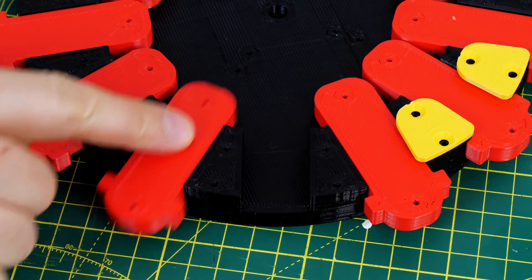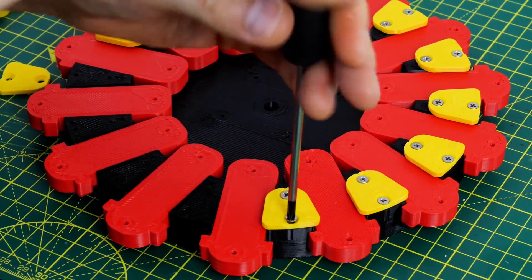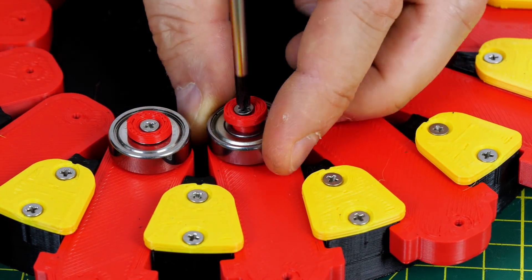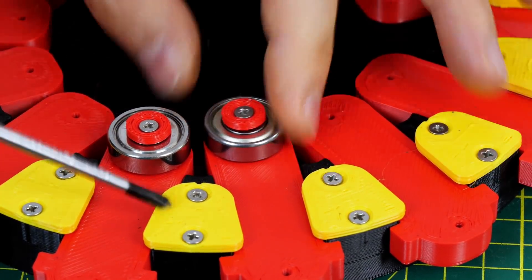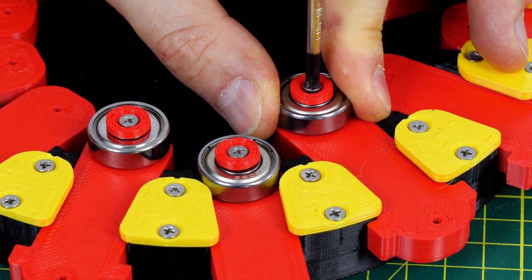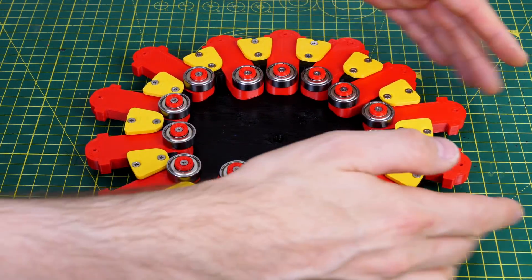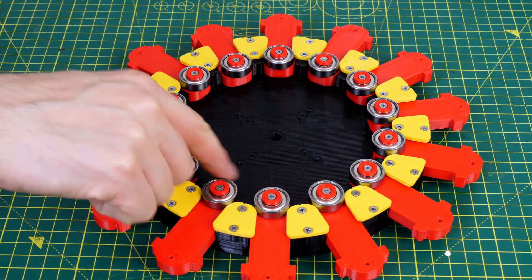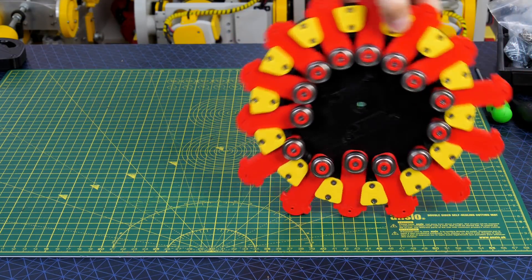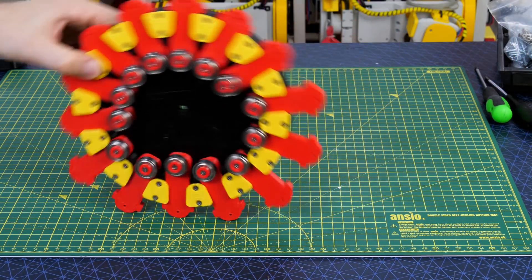Each of the feet on my pedrail wheel slides in and out in a channel that's printed into the base, and then I've got these little yellow caps that screw on all the way around to stop them falling out. The insides of the little legs have to run on the guide, so I've got a skate bearing with an 8mm internal diameter fitted to each one, and these also provide some mass so they flop in and out really well. This seems to run pretty well and you can see there's multiple feet touching the ground on the bottom at a time, and all of those comply with the ground and they run on the flat piece of the guide at the bottom.